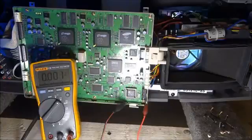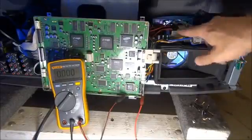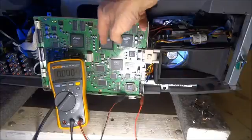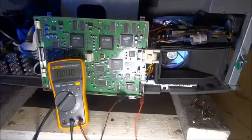They'd really be humming at 12 volts. These sets don't actually need that much cooling. There is one fan, and it's kind of hard to see, but there's one fan over here that cools the ballast assembly that drives the lamp. There's a second fan down here that actually cools the lamp. Back behind the digital board that you can't see, there's a third fan that cools the DLP chip itself. And so that's why we were getting that message to check all 3 fans.